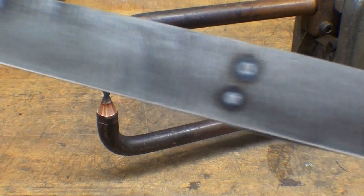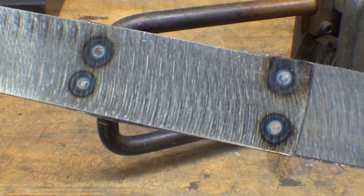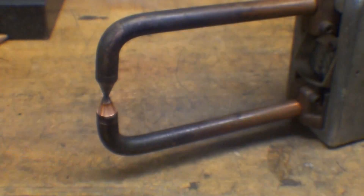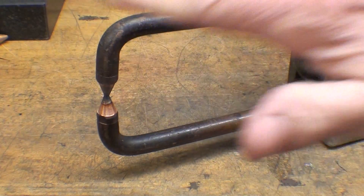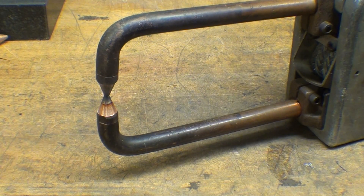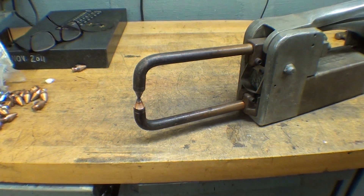So that's spot welding — that's how it works. Notice just a little residue of copper from the tips; I think it's because the tips were freshly turned, and I'm going to show how to do that in the next video. If you want to learn a lot more about spot welding, watch part two. But if you're satisfied with the general principles of resistance welding, this video is over. Thanks for watching — this is Tubal Cain and I'll see you in the next video.